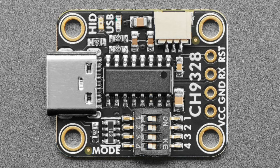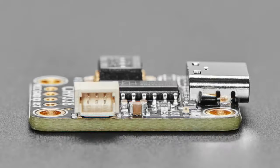But the problem is that there's some microcontrollers that don't have native USB, like the original ESP32 or the ESP8266 or the Arduino Uno, the original Arduinos, or the CH552. Maybe the CH552 does have native USB, but the CH32V003 doesn't, right? So there's some chips that don't have USB that can act like a keyboard. And in those cases, we've historically just told people to upgrade your chip and use a different chip.